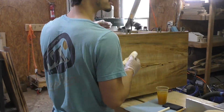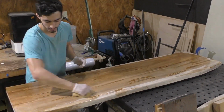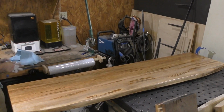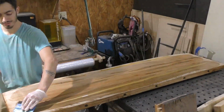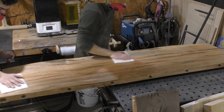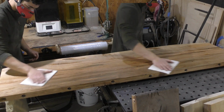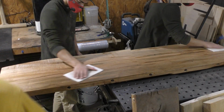But I can show you me staining it. And it turned out really well. The color of this wood was really pretty. I did 2 coats of Rubio Monocoat and then 4 coats of the N3 Nano from Blacktail Studios. And that gives you a super durable, super pretty finish that will last a very long time and is repairable, which is great. So if at any point this gets damaged, the client can call me up and I can very easily spot repair it.